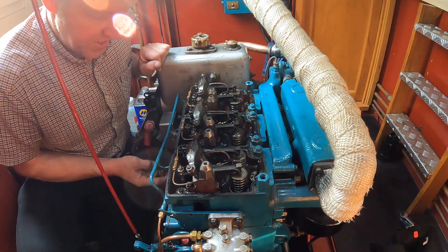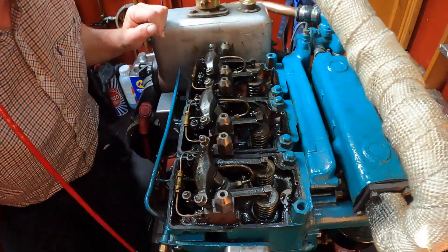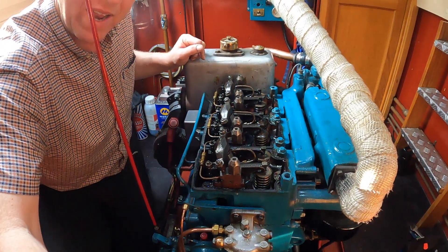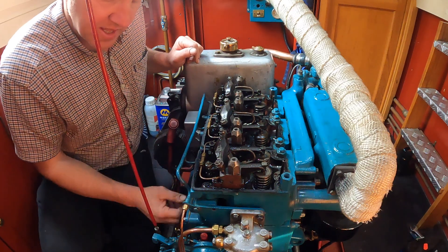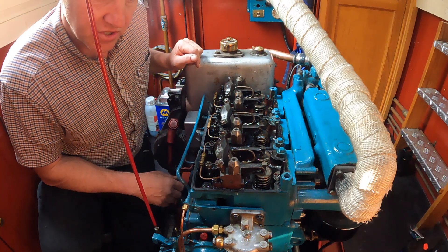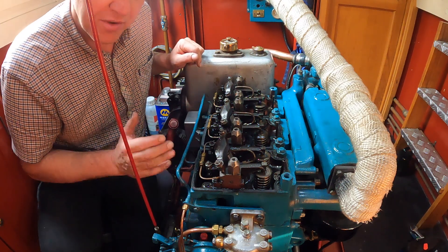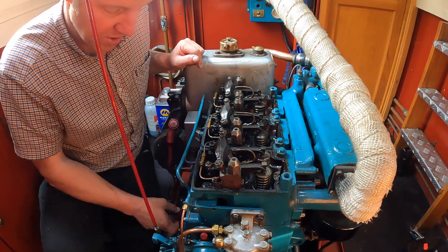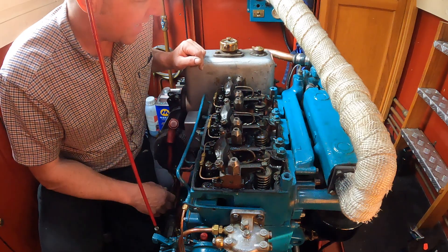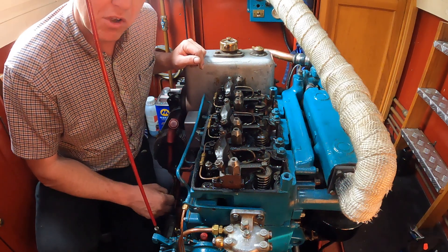I say I had it once — it was actually on the injector pumps down the side here. When I changed the fuel filter on the back end, when I bled it up — each pump has got its own bleed screw — one of the little copper washers must have just cracked a little bit. Then over the next couple of days I just noticed the oil had gone up. I was running and noticed the oil pressure dropping off a bit, shut her off straight away, had a look, and sure enough the oil level was above the maximum on the dipstick. Keep an eye on it — known to Listers, probably to other engines as well. Anyway, let's get the rocker covers back on.